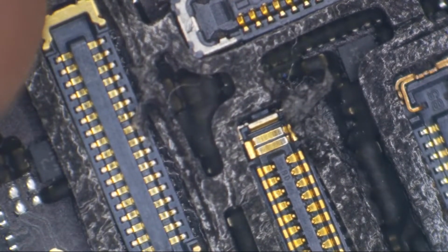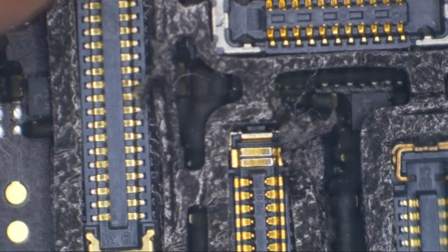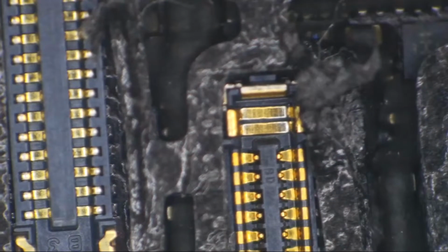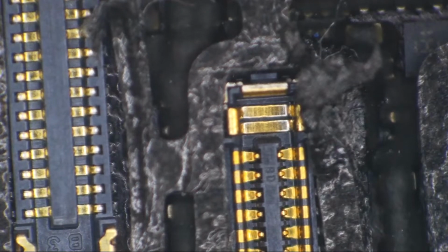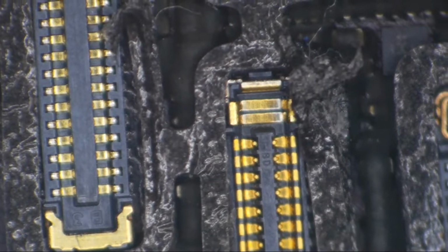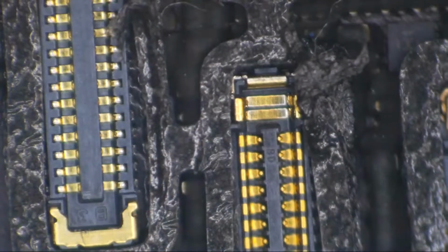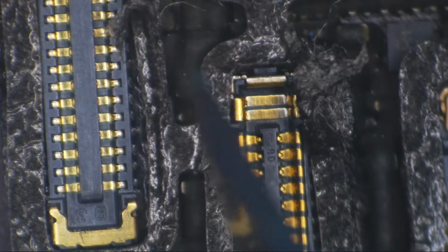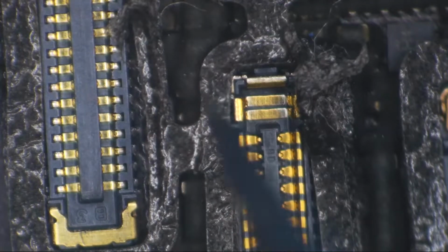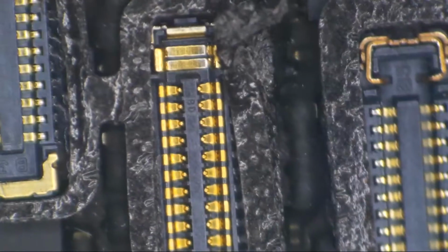Now the quickest way to diagnose a bad backlight on an iPhone 6S, or just about any iPhone, is to look at it with your eyeballs. And on the iPhone 6S, if it's going to be technician damage out at the connector, you will wind up with visible burnt damage here. You'll see solder balls squeezing out. FL4211 is right here, and that is where our backlight filter is, and I don't visibly see anything wrong.